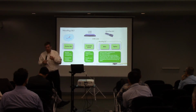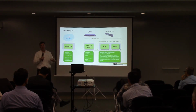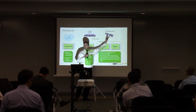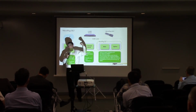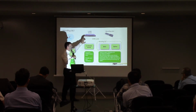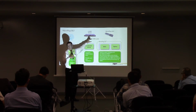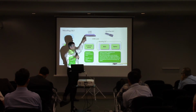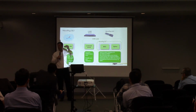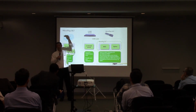And so what we've done is really trying to take this to the extreme of how much can you reduce the actual hardware components in a network to really fit into a CORD environment as much as possible, is to take everything out of that PON-specific device possible, so that you're pulling out switching, you're pulling out CPU management, you're pulling out local management that you don't need, and fitting directly into what is a common and CORD-defined switch, right? So it could be the same switch that you're using top of rack, could be a switch you're using at individual line card levels, and then you're aggregating all of these at a top of rack or maybe an end of row, right?